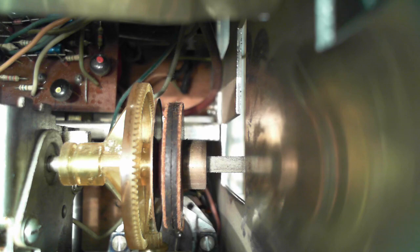But then the metal plate is in the middle too, so how would that enter into it? The metal plate, you'd want the metal plate to be fused to the, would you want the metal plate? Well, you'd want the gear, the metal plate, and the one side of the clutch to all move together to the left when you push the button. So if it's going to pull the yellow gear, it should pull the metal plate and pull the clutch apart. You need a mechanical arrangement to hold that all together when you apply pressure on the yellow gear.